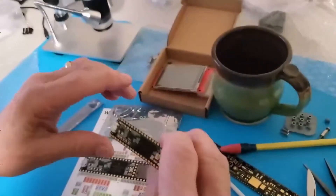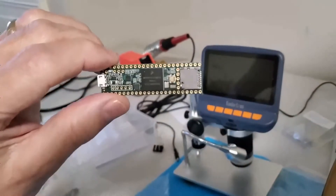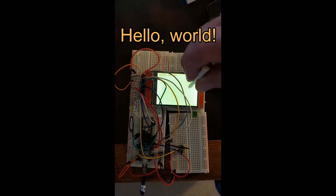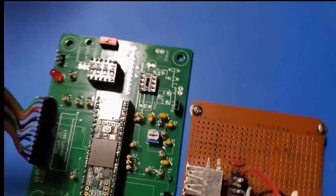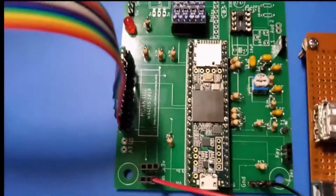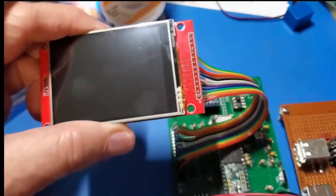No pins — have to use my own pins. The Teensy is very teensy; let me get some light on it. This PCB is partly wired: all the pull-up resistors for the TFT are in place, and I just finished making this beautiful rainbow-colored ribbon cable for attaching the TFT.